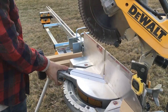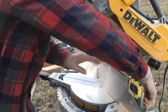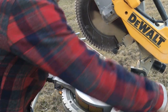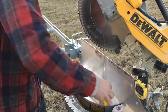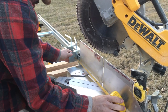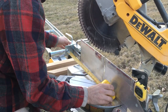All these can be purchased at CFS. He's setting his left fence and his right fence for the left side miter. He's going to go ahead and now set that dimension. We always set them about a 30th of an inch over. And he micro-adjusted it in. He doesn't need to put any kind of marks on the part — he just goes ahead and sets the stop.